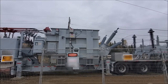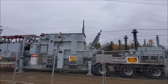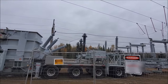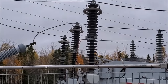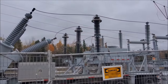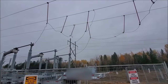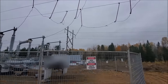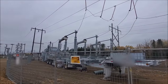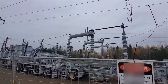That's the actual transformer. This transformer is rated for both 138,000 and 69,000 volts. You can see here the lightning arresters. We have the grounds halfway up because it's on the 69,000 volt setting. That's pretty much it, guys. On the end you see a trailer hitch there — that all folds up nice and neat, hooks onto a transport truck and onto the next one.